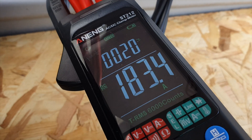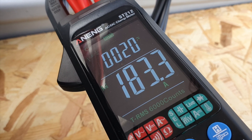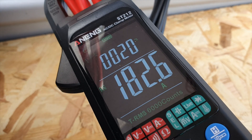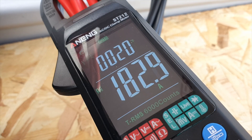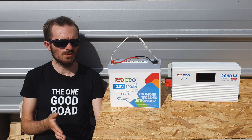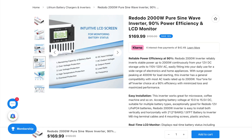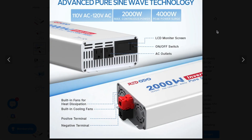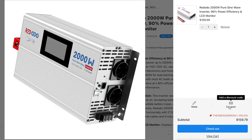In the future it may be better to use a thicker cable. Running a 2000 watt load from the inverter with two mini batteries in parallel, my amp clamp meter read 186 amps — and the unit itself was quite cool, which is impressive. Between the two batteries in parallel, one was drawing about 80 amps and the other about 100 amps. For the money — around 180 to 190 euros for the EU version, or about 150 to 160 dollars for the US version on offer — it's a fantastic, high-quality inverter.